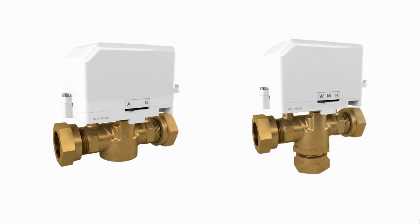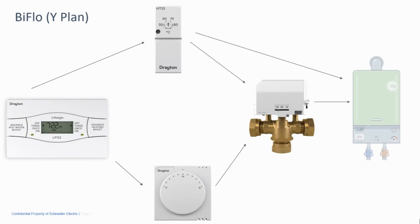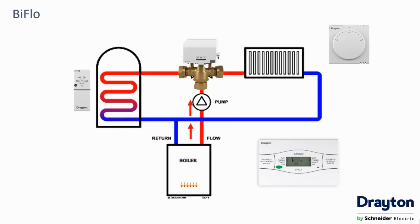The valve bodies come in two configurations: two-port and three-port. The type of valve fitted determines the type of heating system. Here we have a three-port body and a mid-position actuator — this is known as a bi-flow or Y-plan system. The movement of the actuator is influenced by the outputs of the time and temperature controls fitted to the heating system. The valve is fitted after the pump and allows for independent demand of hot water and central heating by opening and closing the relevant ports.